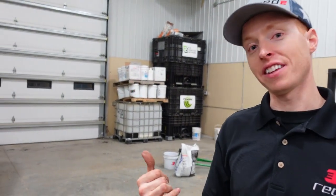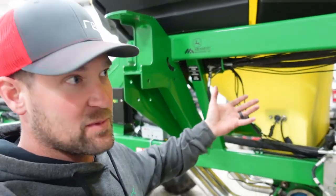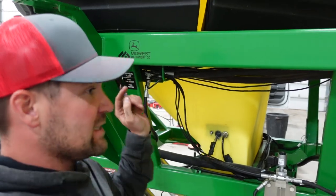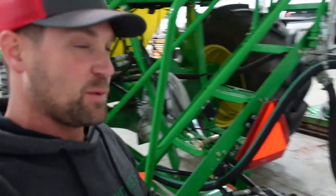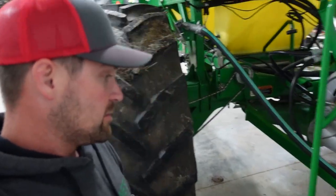We found out that it's an open center valve on the hitch, on the winch. So when we divert the fan and put pressure to our hydraulic motors, because it's an open center valve, all the oil flows right through the valve and won't spin our motors. We have never had an auger on this cart, which is something the guys that run seed with them and do planting would have — we do not have a diverter valve up here. Right now we have jimmied it through the winch by pulling the pin and running the winch to make it flow the way it needs to.